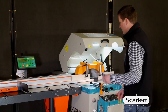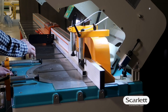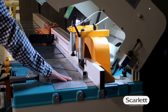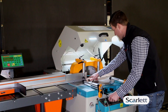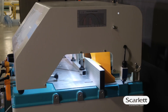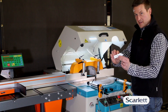It's a great solution for cutting aluminum extrusions. Now we've been cutting 90 degrees and we want to change over to cutting a 45 degree miter angle. It's really easy. You loosen up the hand screw here, pull the knob, and you rotate the base from straight zero over to 45 — it locks in. Tighten up the hand screw and you're all set. Lock the clamp down and you're good to go. Close the cover, double thumb switches — we're cutting 45.